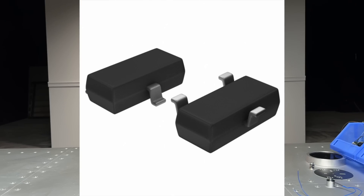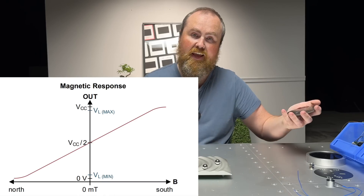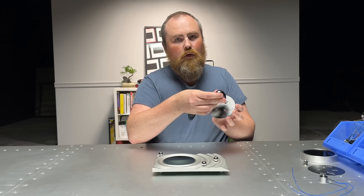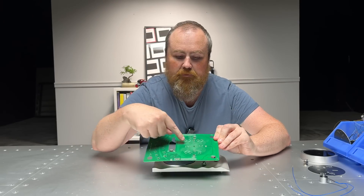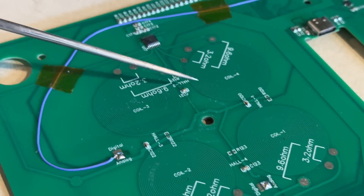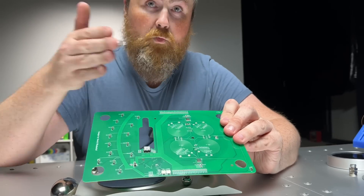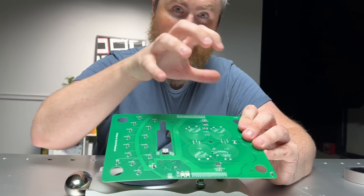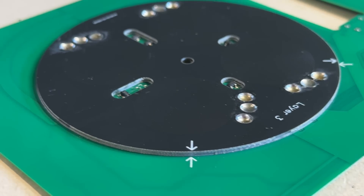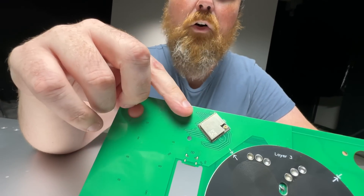To do that we can use analog Hall sensors - sensors that sense how strong a magnetic field is and output an analog signal according to field strength. With multiple sensors around the board, we know where the egg is by doing a lot of math. We have four coils for a lot of power to get it started. We can fire these north or south using motor drivers, pushing and pulling every single coil individually. Depending on where the egg is, we can push at the correct spot. And it uses these sensors to know where the egg is at all times - a processor does the math.